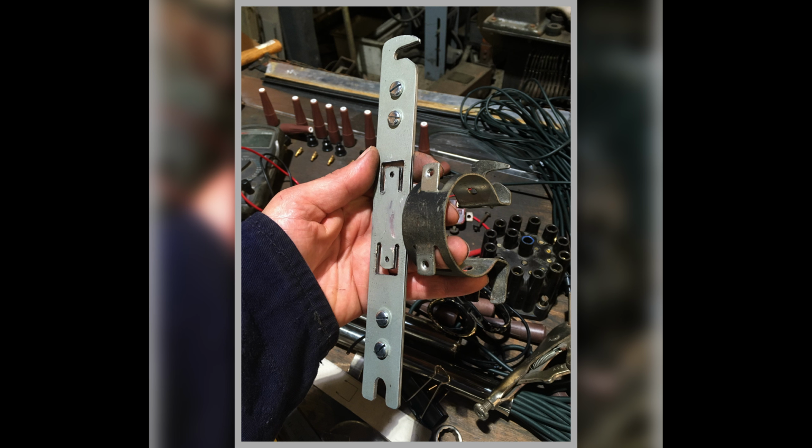So again, I had to make them. That's a bit of steel where I pierced them out. They have to be identical, so I bolted them together so they'd end up identical. But that's the original one in the shape that would hold the coil. That's what it would look like flattened out with the corresponding lugs and so on on it.